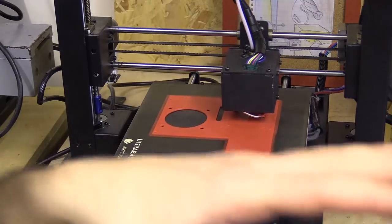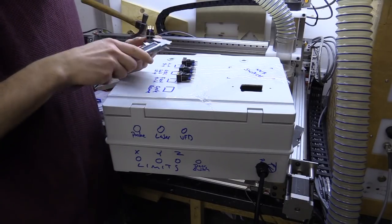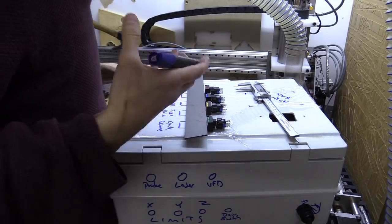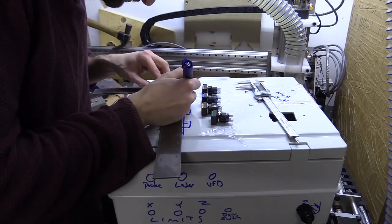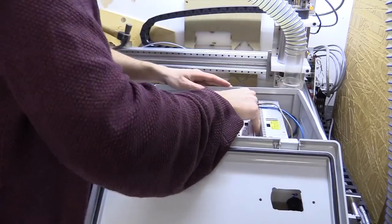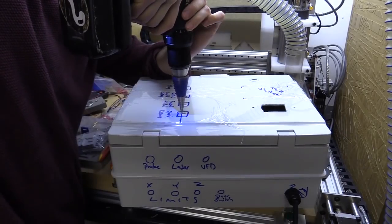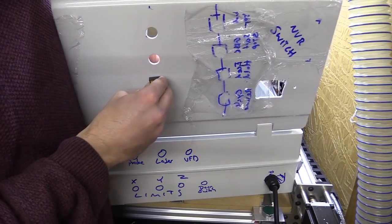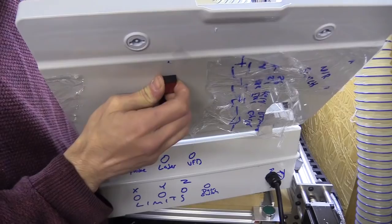While that prints I'm going to make the holes for the buttons. These buttons were by far the cheapest of the 24-volt LED back-click variety that I could find — they're not great but for low DC voltage applications I think they'll do. I'll place the parts back into the box just to double-check I'm not going to conflict with anything. After laying out the parts, I used my step drill to make the 16mm openings to mount them. I have four switches at the front: the red will connect to the controller hard stop, the blue to the GRBL reset or soft stop terminal, yellow or amber to the hold feed, and green is for resume and start.